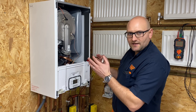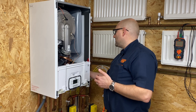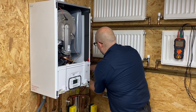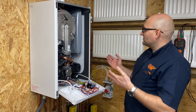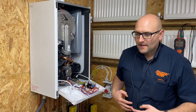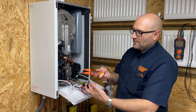Now we're going to look at the safe isolation part of TB118. I've got the boiler on — the LCD is on, you can hear the boiler. I've got the fuse spur here, so I'm going to remove that fuse spur and retain it so no one can re-energize the boiler. Dropping the frontage, we can see that when I pulled the fuse spur all the lights went out and the boiler stopped making noise — so it's clearly dead. But do I really need to do my safe isolation checks with my two-pole tester? I'm a stickler for the rules, so I will carry out the checks.